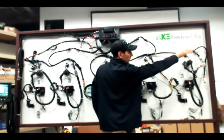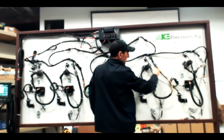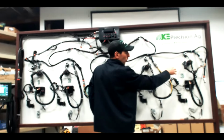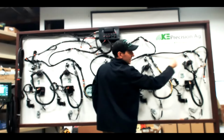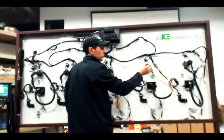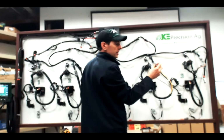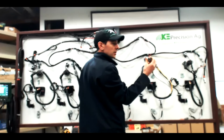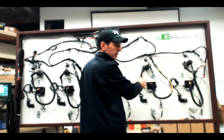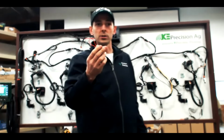It's going to bypass that row, and if the break's on that row, it's going to move all the rows back. And so the very last row is going to turn red because you bypassed that one row in the middle. And all the modules past that re-identified themselves. So using this plug will cause the last row to turn red, but it can be used to pinpoint that there is indeed a daisy chain break on a certain row if that blinking line disappears when using this plug.